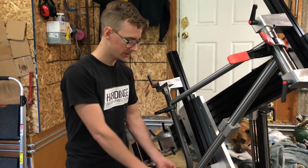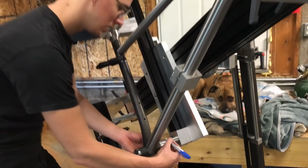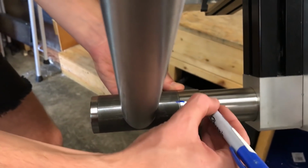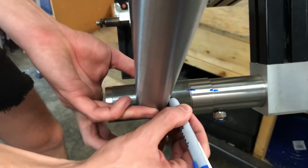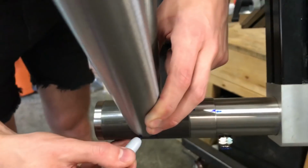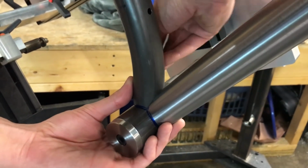So I need to add some holes to this bottom bracket shell so that the gases can flow through these tubes. The way I'm going to do that, I'm thinking, is I'm going to put a mark here that spans across these, and also because this can spin, I'll do it here, whatever. That'll help me phase this up. I'm going to trace around these, which I've already sort of done. Yeah, it's kind of tricky getting it to follow all the way around. You get the idea. Just tracing around the outside.